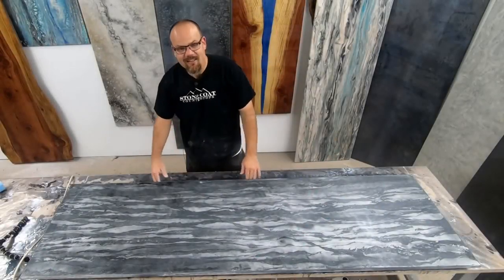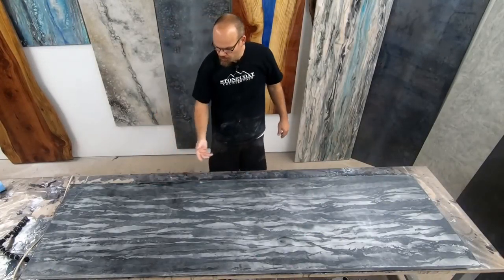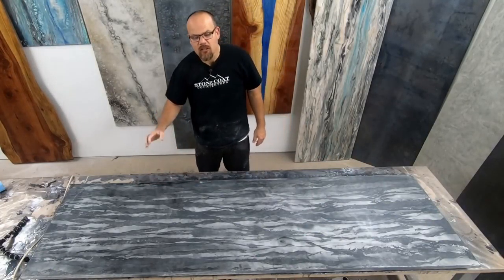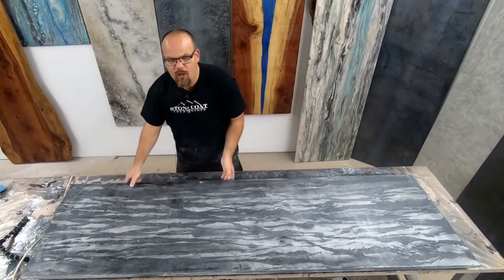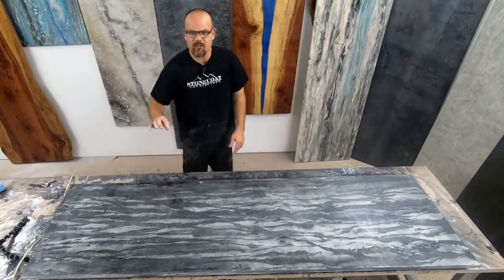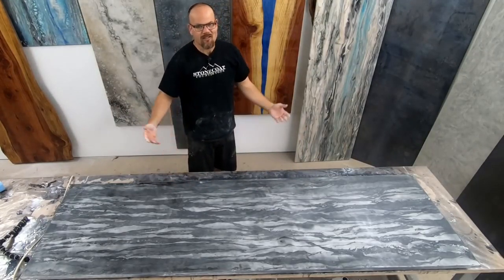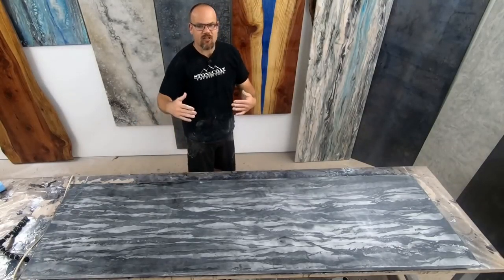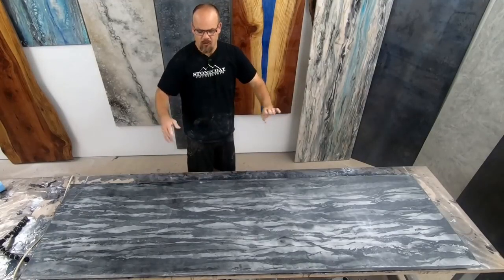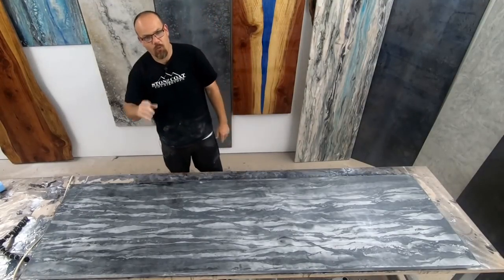What we did is we did 220, then the edges with 220, and then finished by hand on those coves. When you do those edges, turn your sander down and do the coves — just remove any of the voids. When you rub your hand on it, it feels really smooth, but don't go too deep where you burn through that edge. You don't have to get it perfect, but make sure you feel it because when you get the polish back, that's what you're going to feel. Some imperfections in the sheen won't show through, but how it feels is important.